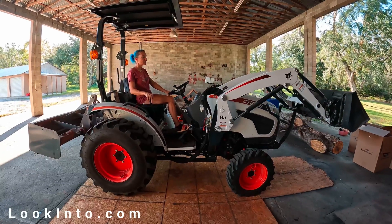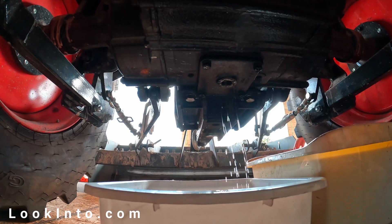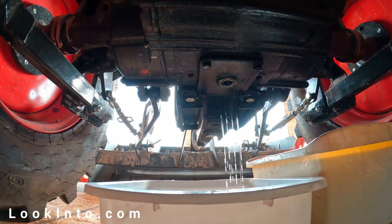I also use an air compressor to blow dust off the engine air filter. Next up is checking all of the wheel nut torques. The manual says we want between 144 and 166 foot-pounds for the rears and 57 to 67 foot-pounds for the fronts. Torque them and use a white paint marker to make a line so you'll know if they loosen over time.